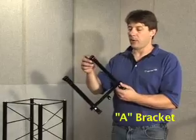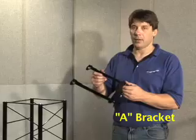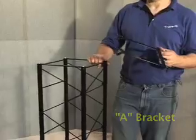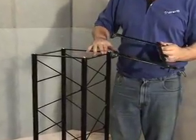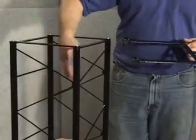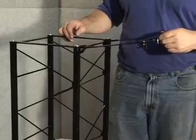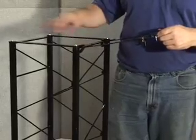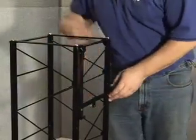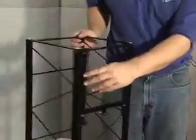Here's the A bracket. It's our simplest bracket, with no hole in the vertical sections of it. To install it, it's only installed on the very tops of columns and on the lower bars — top bar, lower bar. The lower bar is either on the ladder side or opposite the ladder side. To install it, you bring the bottom of it parallel to the top, slide it over the bar, and drop it down into place. Turn the little keepers so that they lock against the tubes.